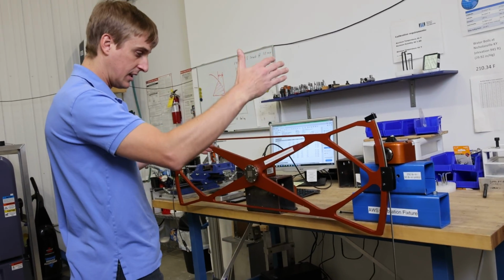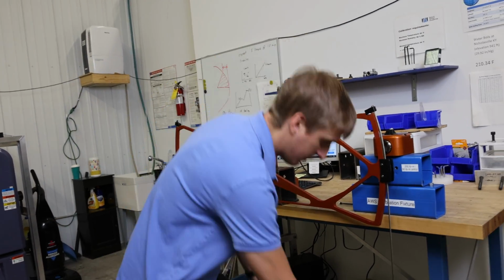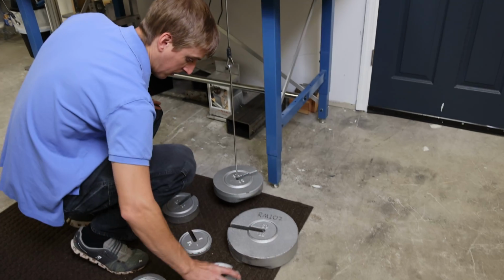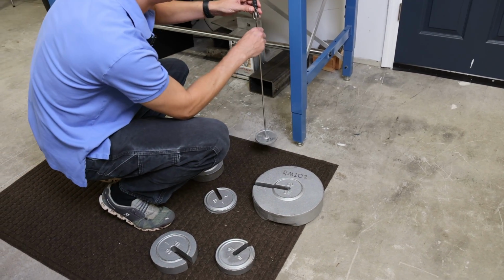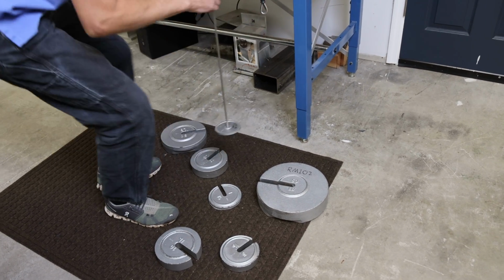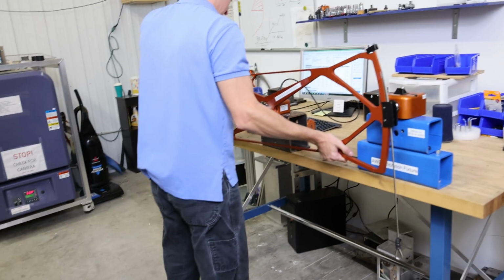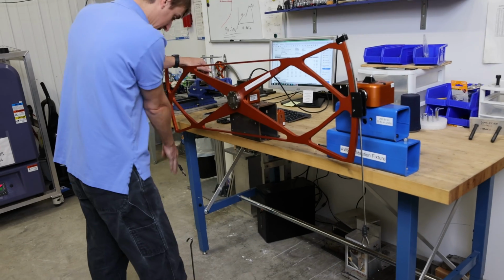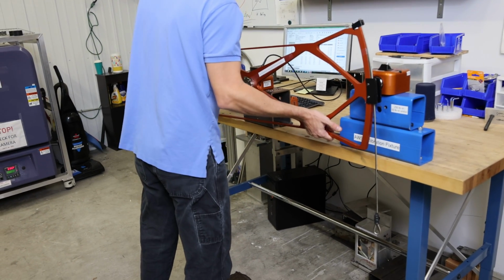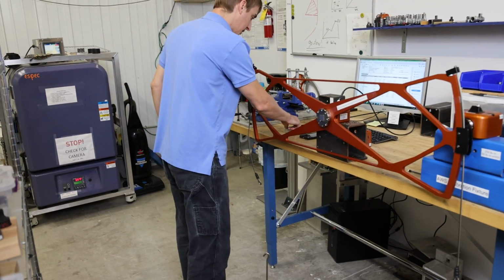After we've done the clockwise direction, we'll take it off, and I'll just set up and show the counterclockwise. Again, we exercise the unit in the counterclockwise direction. Best way is just to put full scale on it, on the whole system, but for this demo, I'm just going to cheat and manually index it. And we'll tare.